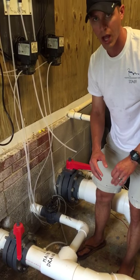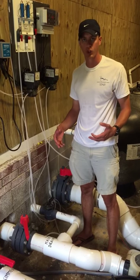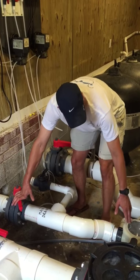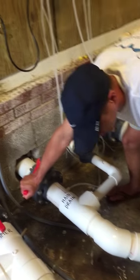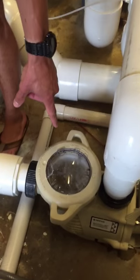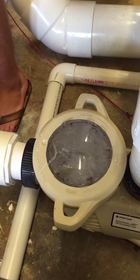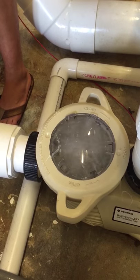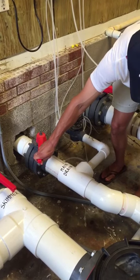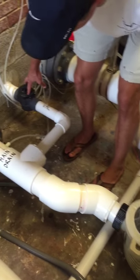In normal circumstances, in normal operation, that's not ideal — putting that stretch on the pump. In this case it's fine, because you're only doing it for a short period of time. What you're doing is dialing the main drain to halfway. What I don't want to happen is I don't want to dial it back so far that I actually lose prime. If you look inside the pump now, it's not filled with water 100%. If I dial it back to the halfway position, it fills back up completely. You still want your pump to run with 100% water, so that your pump is still running at 100% efficiency, but you have as much water going through the vacuum line as possible.